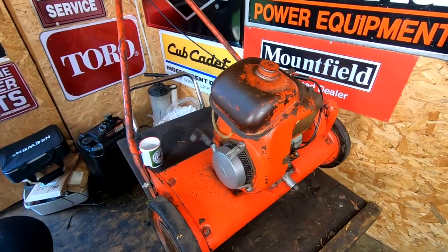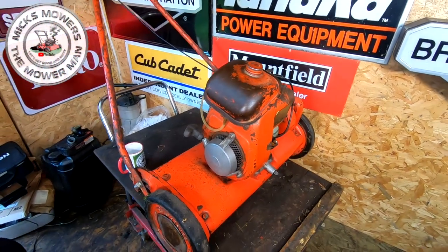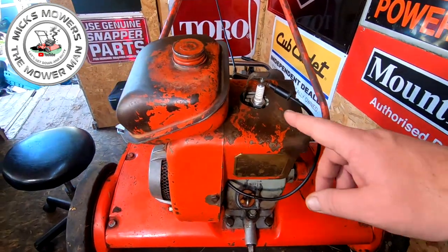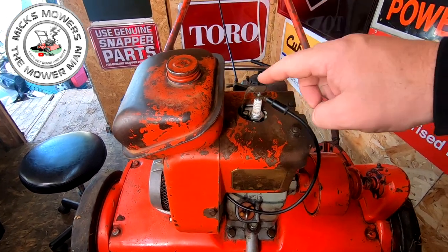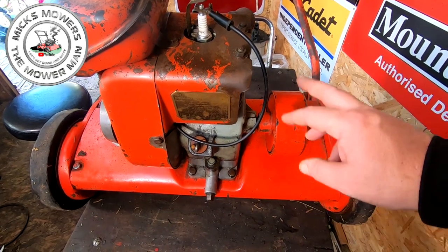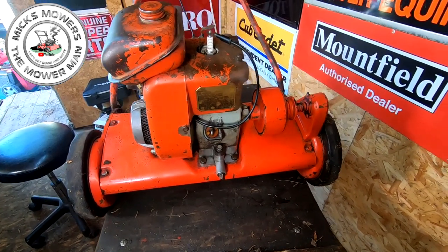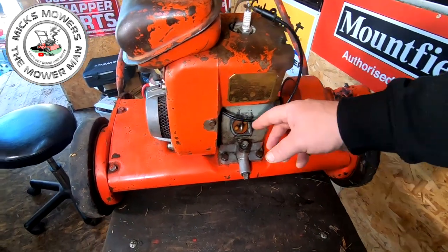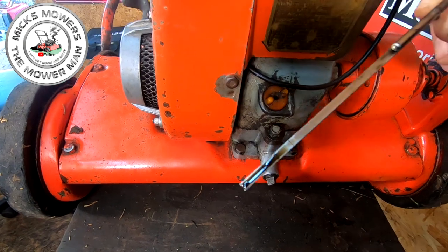Right, so up on the bench - Suffolk Corporation Mark II mower. Bought off a YouTuber, absolutely surprised to see it on eBay, and it's been sold to me by a lawnmower repair guy, so he's done it all - I've got no work to do on it. There's a little brand new spark plug there, and a kill switch - you just tap it over to stop your engine. On some machines be a bit careful because you can get a little tiny belt off it. Centrifugal clutch as well, so when the machine's in idle it'll just idle up, but the second you put the revs up, the clutch kicks in and the blades start to spin. This is also self-propelled - the wheels are driven. 1960s self-propelled mower. Lovely. There's a dipstick in here - you can read it off a little tiny split pin, which is all marked up. All up lovely.